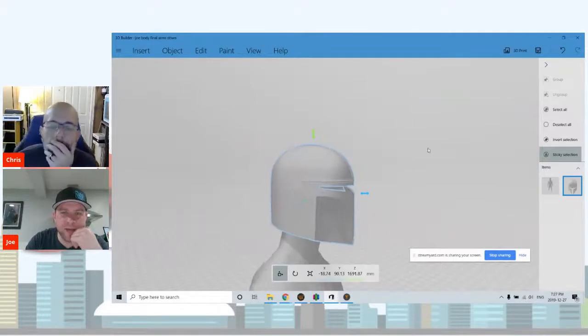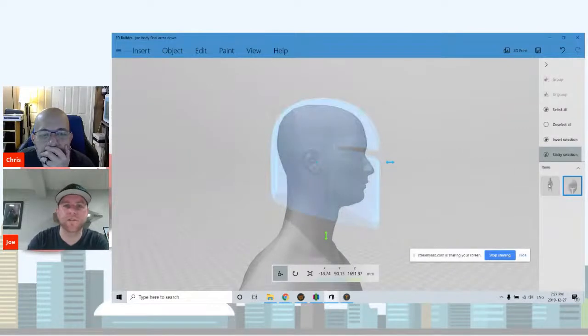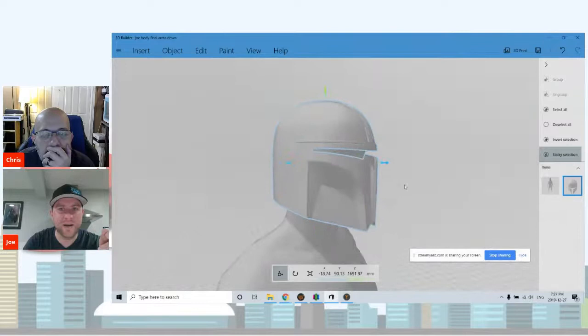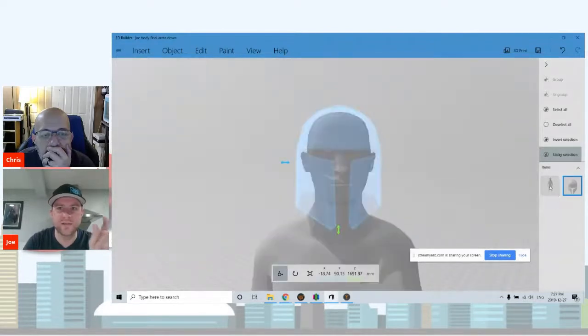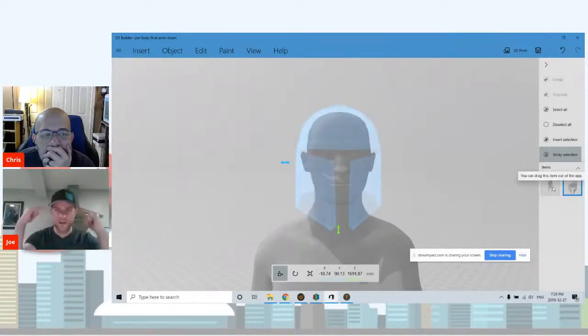In any helmet that you're going to 3D print, you want to have room. 3D printed helmets do not feel very comfortable on your head when they're sitting on your head by themselves, because it's hard plastic. They move around all the time because you're not secure. So what you really want to do is have space inside to add little strips of foam. I take these little 5 millimeter thick sheets of foam and cut them into slices. I'll do one that goes all the way around the sides of the head and around the back, so it fits nice and snug.